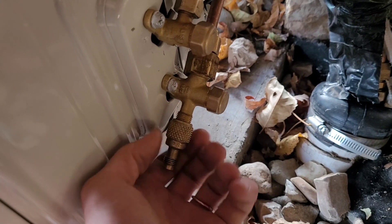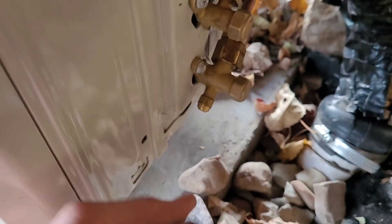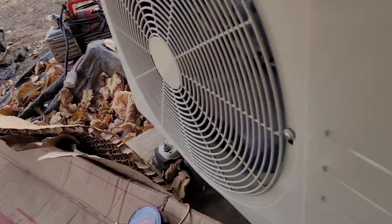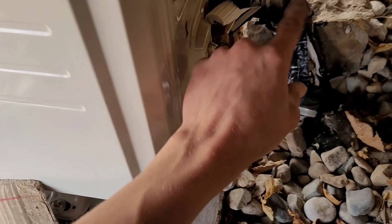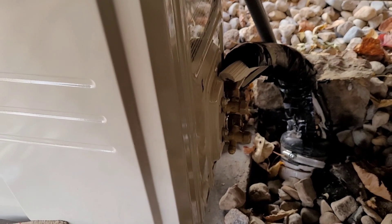I'll try to link in the description to some of the stuff you're going to need, like this port adapter. Obviously you're going to need refrigeration gauges and a vacuum pump. If you're doing a line set that's flared like this, an eccentric flaring tool is really good to have. You're going to want to look at the instruction manual for whatever unit you're doing — it does vary unit to unit as for how much refrigerant you actually have to add. If yours calls for more, do more; less, do less. Anyway, I hope that you enjoyed and I'll talk to you later.